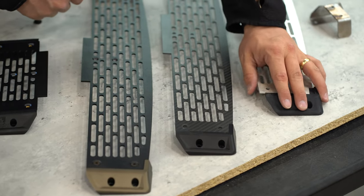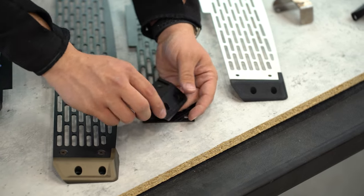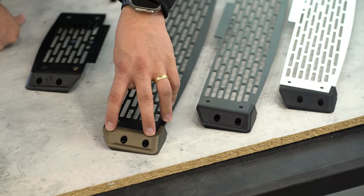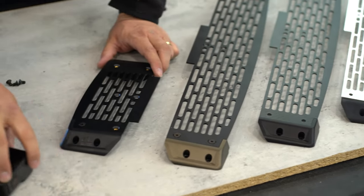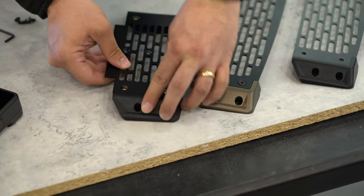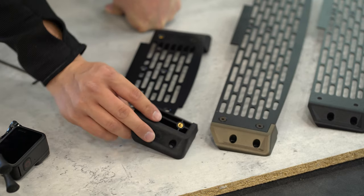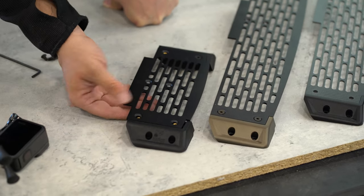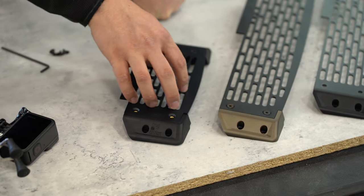That is the 3D printed end piece we used for early prototyping. The other material we looked at is billet aluminum — a couple of different finishes. Aesthetically it's really nice, feels solid. But when it came time to commercialize the product, the aluminum billet pieces were just adding a ton of cost without a ton of real benefit. That's how we landed on the production parts: a glass fiber composite injection molded piece — very similar design aesthetically, with brass inserts to connect the two pieces, but way more affordable. Doing these out of aluminum would have added about $50 to the MSRP, which didn't keep it competitive.